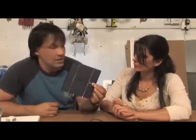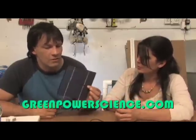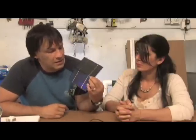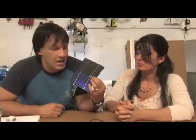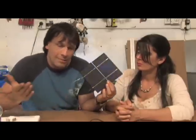You have to add the case cost to it too, because sealing these — the Harbor Freight system has been out in the sun, been out in the rain, been dipped in water, and they work fine. Can it be embedded in acrylic? Yeah, you can encase this in resin — you can definitely do that with different types of resin. You just want to make sure that the contacts all stay good together. It's really important to test these as you go along. You also need to add some blocking diodes to this, because you don't want it to drain your battery — you need to make sure the voltage only goes in one direction. This process is good for somebody who's on a budget, who has a lot of time on their hands, and who is very patient and wants to do it yourself. If you're not that type of person, buying a pre-manufactured system is going to cost you probably double, but that's your call.